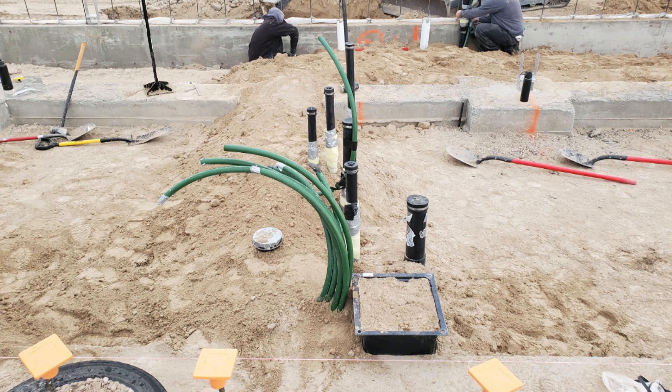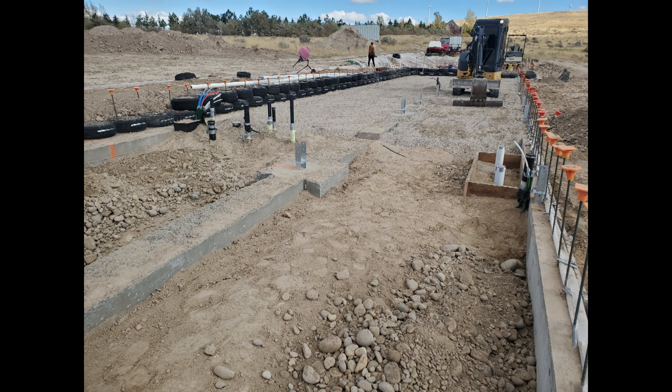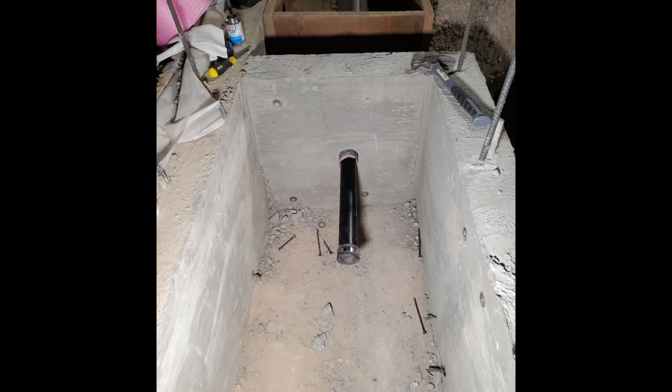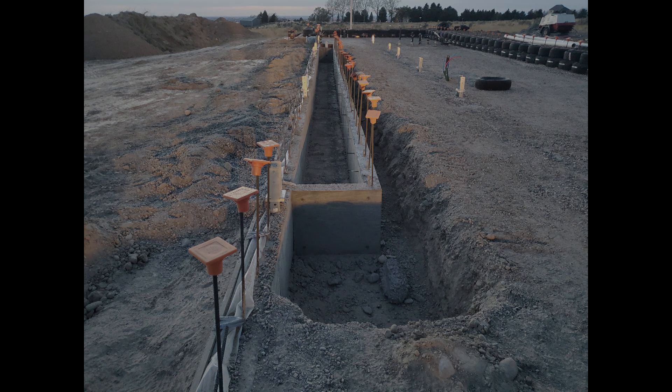Not all the lines we needed to run would fit through our 6-inch sleeve. Worse than that, the elevation of the sleeve was low enough that the feed pipe for the planter would have been at the very bottom of the planter, and that clearly wasn't going to work. We stressed about this for weeks, but thankfully our plumber helped us figure out a solution, which was to notch out the top of our footing and run our gray water pipes over that, which allowed it to run into the planter at a higher elevation. We'll still need a pump to get the used gray water back over to the bathrooms where it can be used to flush the toilets.